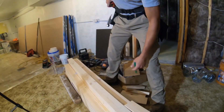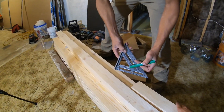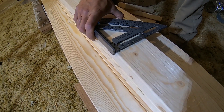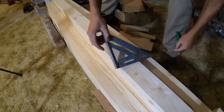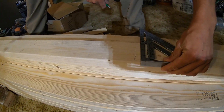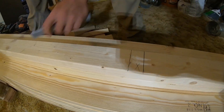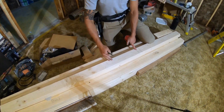To speed it up, you could just mark the leading edge and then use a Swanson speed square — it's marked at an inch and a half, which is really nice for laying out trimmers and jack studs for your windows. You have your leading edge, strike it across, and then line up that edge and this edge will be at an inch and a half.